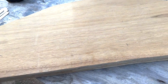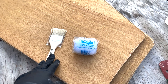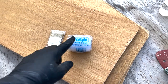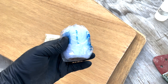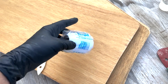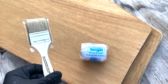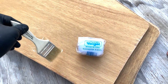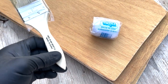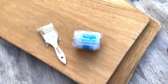But once you put wax in it, that's it — that's your final coat. In terms of the tools and consumable items I'm going to use, I got these from U.S. Composites as well. It's a three inch by three eighths nap roller that's designed for fiberglass. And then I also buy a box of industrial grade chip brushes — that's to help go through all the edges. I try to get a whole box at a time. I've got about 30 plus of those laying around.